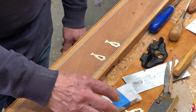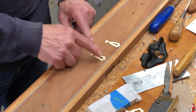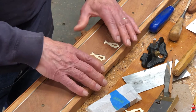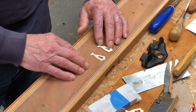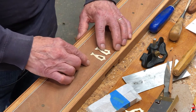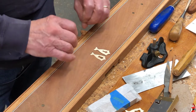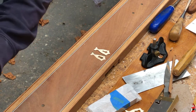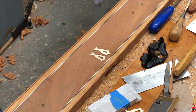I've got a little backing board with wax paper around it so it doesn't get stuck. I'm going to use quite a bit of hide glue in here and then clamp it down. Then I'll have to clean out the hole later — after the glue gels up I'll clean it out from the back side, after I take the clamps off.